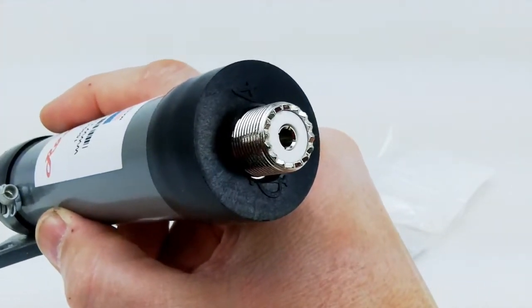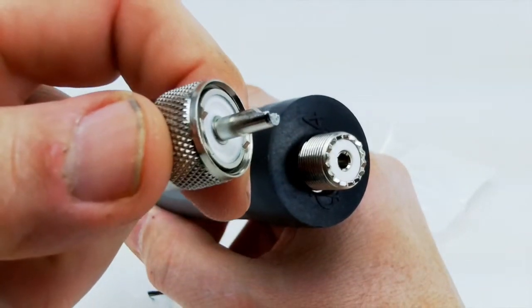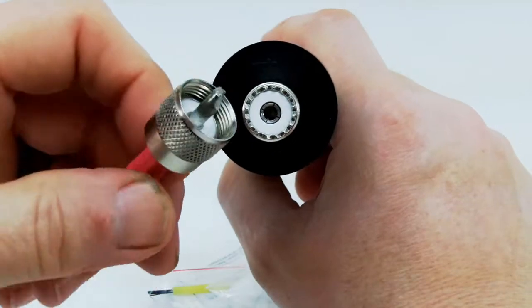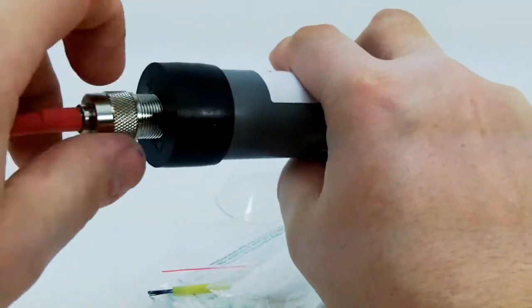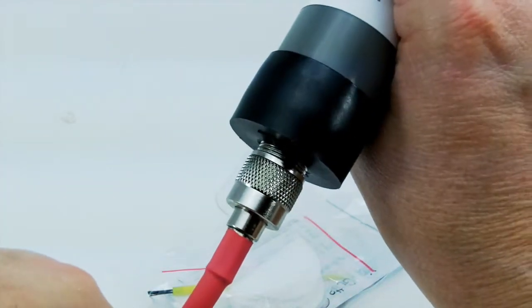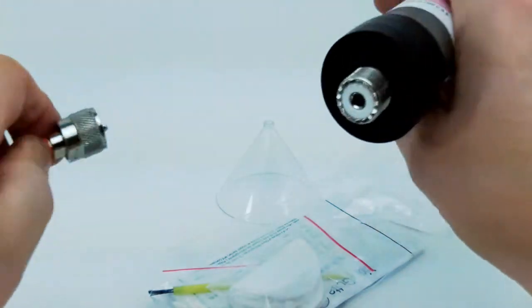The same thing on a regular coaxial connector. You'll see that the connector itself has quite a few different places where it's just open, there's nothing there, just open air. And the UHF type connector has no real gasket to prevent water or moisture from permeating into your connection. So over time, the connection, just by its very nature, will get soaked, and then your coax will get messed up and you'll have to go get it replaced, and it's not very pretty.